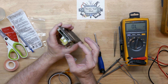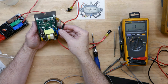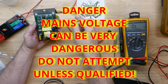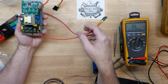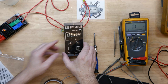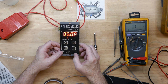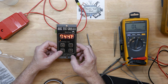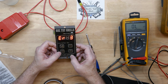Let's go ahead and do some testing. I'm going to connect 120 volts to our supply. It shows hot and common here — it can be very dangerous working with mains voltage, so if you're not qualified to do so, don't do it. A lot of parts on this board are going to be hot with power applied. We'll take our quick test, close it, and power it up. Version 1.02 — this is a pretty old controller for sure. We do see that our lower button works, but it's probably throwing an error. Error three — on these controllers, error three is a probe failure or overheating, and we don't have an RTD connected.